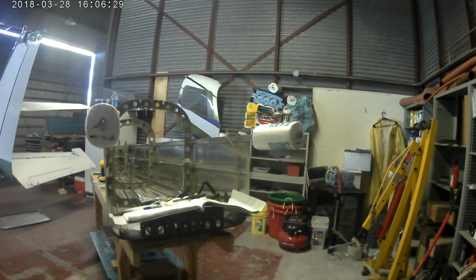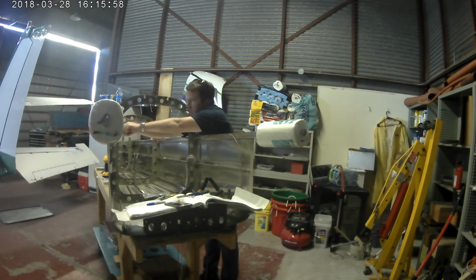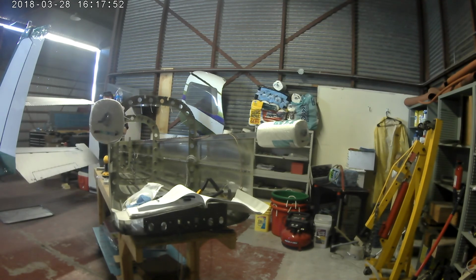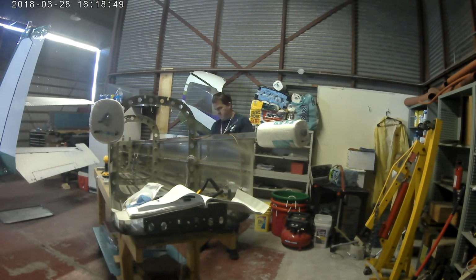We've got 1/8 inch ID pitot line, or clear plastic line, that attaches the alternate static source on the right over to the left. There's a small section of the same clear 1/8 inch plastic on the left side, which then goes into a T, and the T then goes down and increases up to a 1/4 of an inch and then goes up front and will go into the ADAHRS unit, which will now be in the left wing. I thought it was going to be back there, but it's going to be on the left wing.